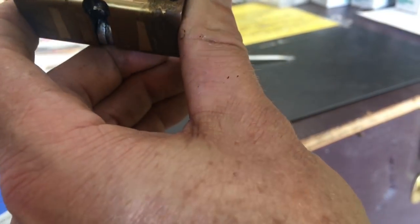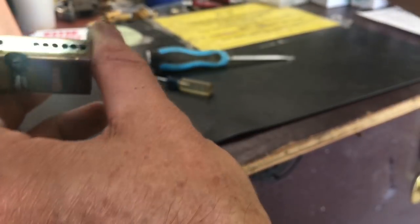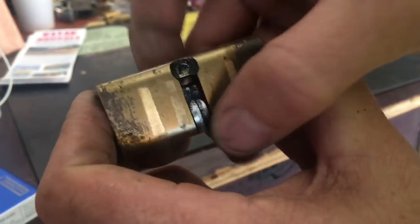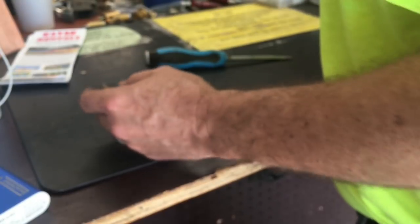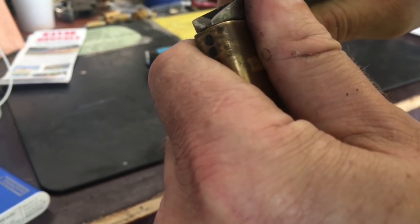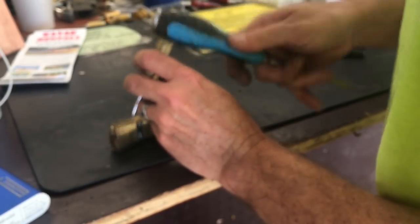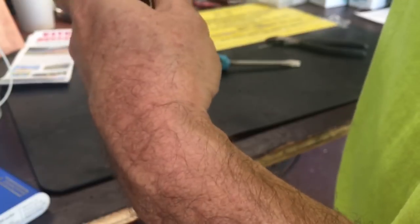Now as soon as I get it past that one, I want to clear the chamber hole a little bit, grab my flashlight, and look in there — and I can see the pin. So if you deform that chamber hole, you may have trouble getting that pin to drop out. But it doesn't really matter as long as you can get the rest of this out. And once you have a good little piece sticking out there, you can typically — but not today, of course, because it's going to be stubborn for the video.